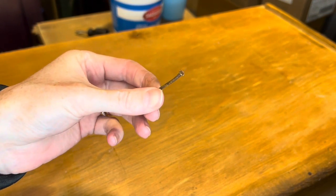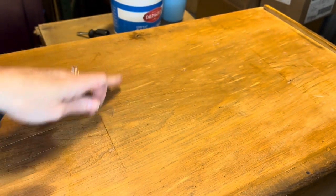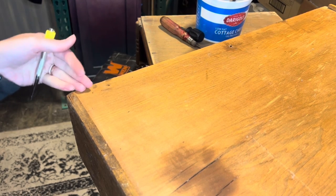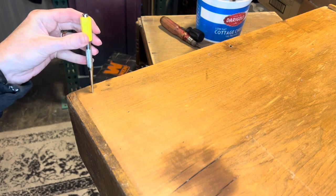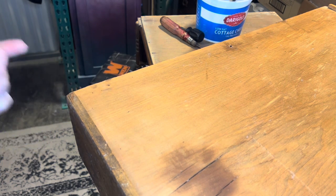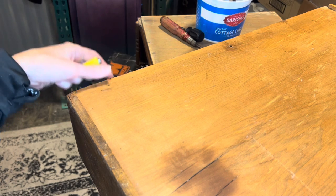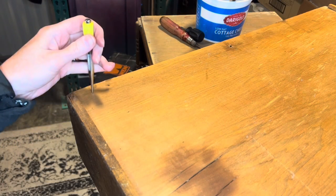It's a fairly large nail for its intended purpose, so I'm going to toss this one and use a smaller one when I go to redo this. Since these pin nails are so incredibly small, they're also sunk, so I can't lift them out. What I'm going to try and do is use this punch to knock them further down just out of this wood — they'll just remain in this. Another option would be to cut the nail, but I don't have a hacksaw and I'm definitely not going to use any of my good saws for cutting a metal nail, so we're going to go this route.